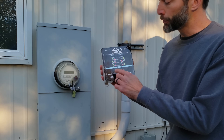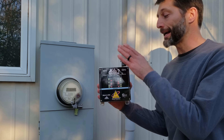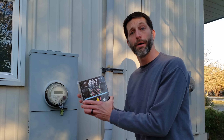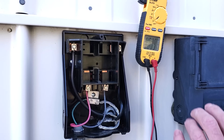The whole point of the CoolGuard 2 is to monitor for high voltage or low voltage on both legs of the electrical circuit, act as a safety switch to cut off power to your mini split if there's a problem, and protect the system against any electrical surges. Now we're going to go ahead and install this.